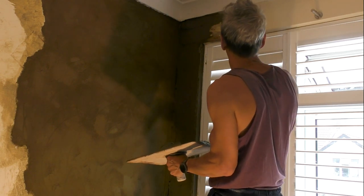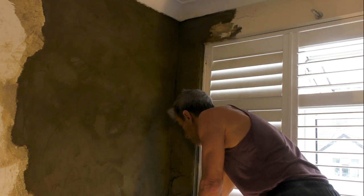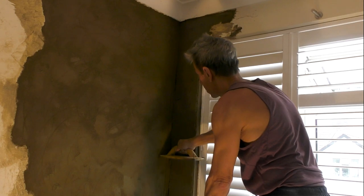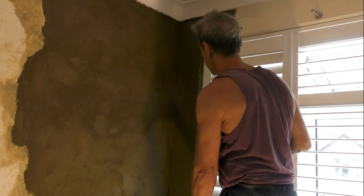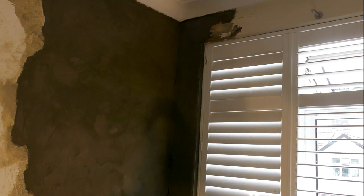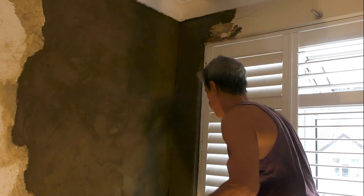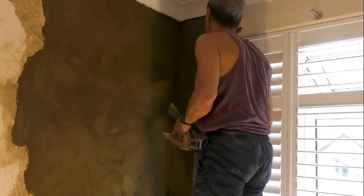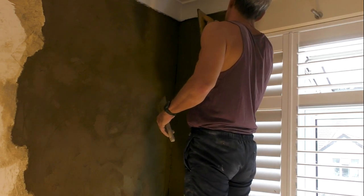What you'll see briefly a little bit later on is where the top bead is in good nick - I've scraped back the finish from the front surface of that head bead on the top of the window. Because when it comes to the setting, I want the beads to all be leveled up with each other on the corners - you don't want one jutting out more than the other where they meet.